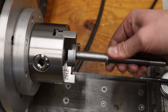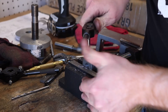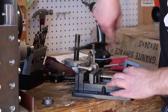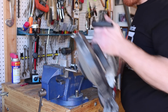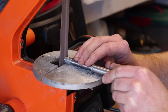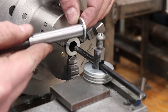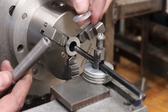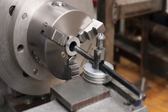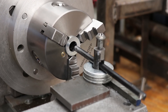I tested the fit on the downfeed screw, then went ahead with installing the set screws in the graduated disc and the ball crank. I double checked my measurement and then I cut the threaded end of the downfeed screw to length, then cleaned up the cut on the belt sander. This chuck is awesome — just simple stuff like taking this washer and making it so it's got a half-inch hole on it. That kind of stuff is super helpful, just being able to pop it in the chuck. Done. Job done. Awesome.